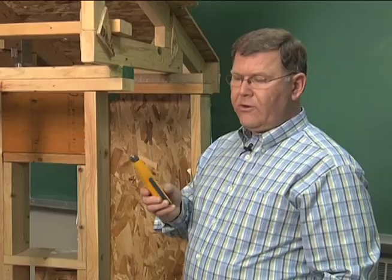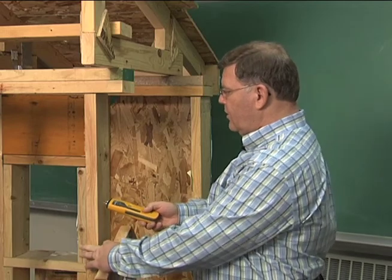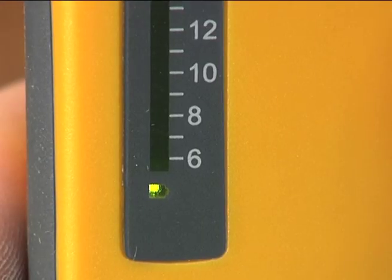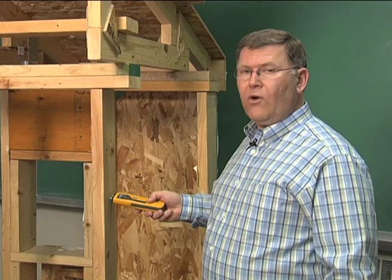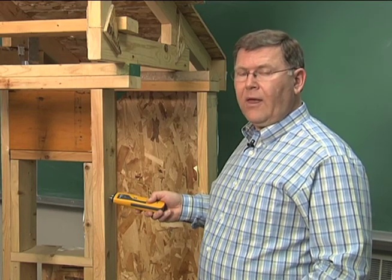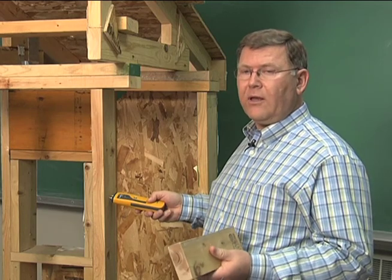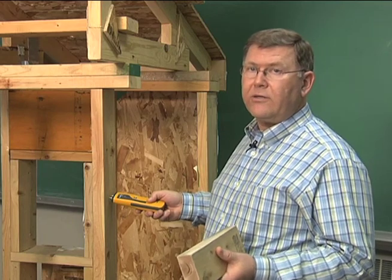If we're under that moisture content — below 15% moisture — that's where we would want the wall cavity to be. When air dried down below 15% moisture, that would indicate we're dry enough. This drying may take weeks, so it's not something we would expect to occur in just a couple of days.